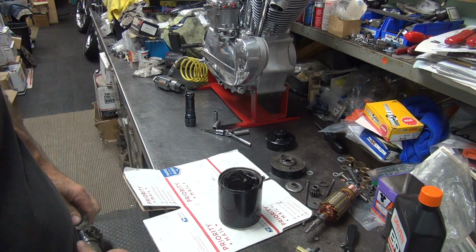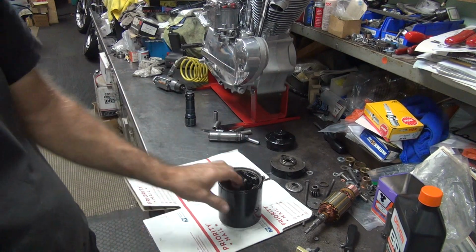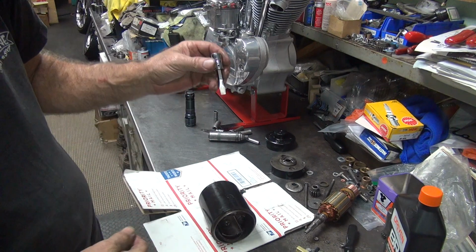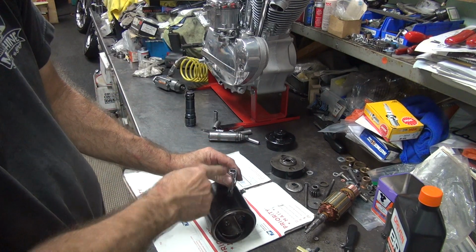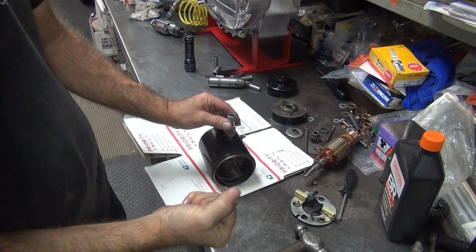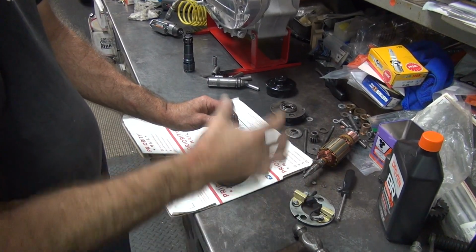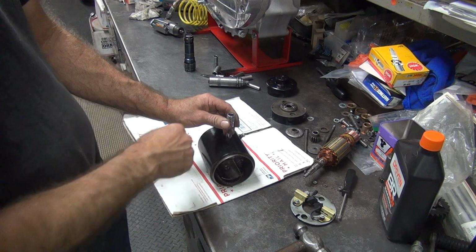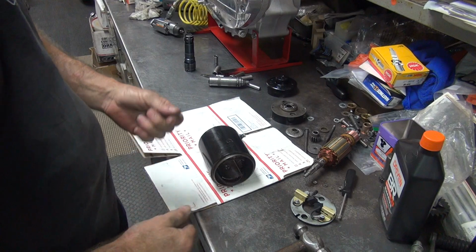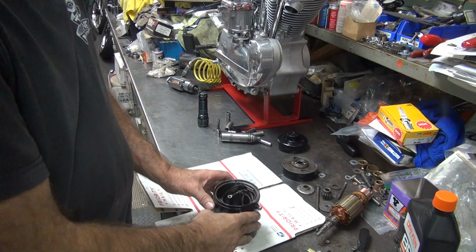Like I said, the tooling they use for these is a big press. They've got a press that holds this in a V block or something, probably a U, actual real block. These go in here, you put hydraulic pressure on top here to hold it engaged, and you have a big handle, you tighten it or loosen it, depending on which way you want to go. So it's just done with force, so it doesn't have any beating on it. And as you're tightening it up, it automatically pushes down on the screw, keeps it engaged tight in there, otherwise you twist it off. Once you get any movement on these, it just rips and twists it right in half. So I've never made tooling like that before, so there you go. That's why I don't screw with these.